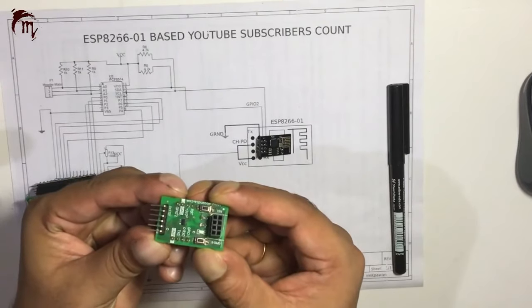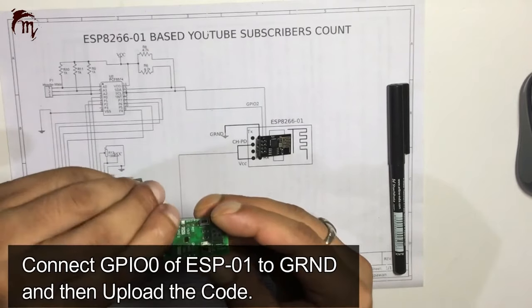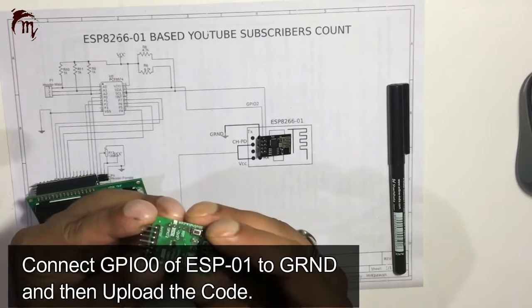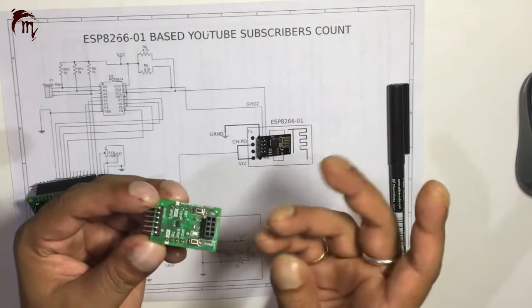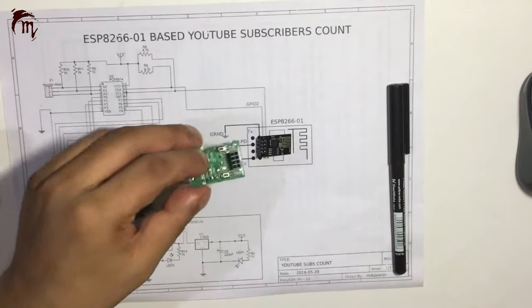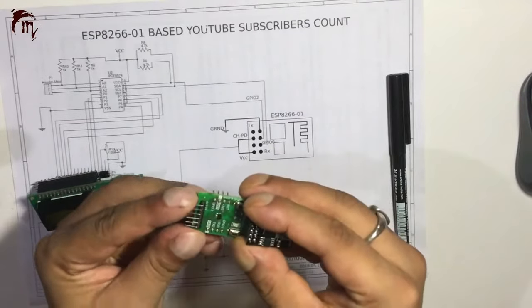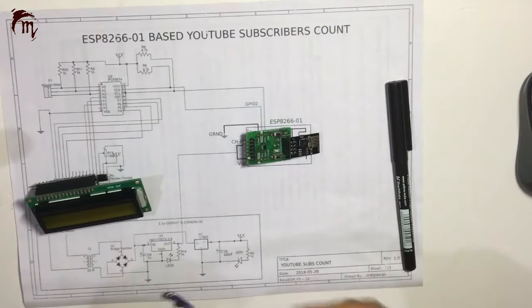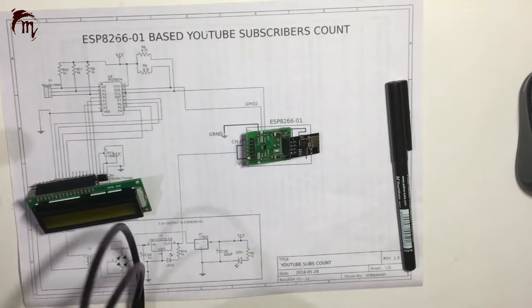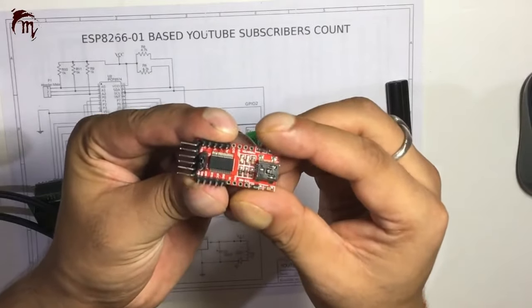this programming module. If you don't have this one, you can do it manually by putting your GPIO 0 to ground first and programming it, and then after you can disconnect it from the ground. So to program this or to connect this one with your computer, I am using a USB to TTL converter which has 5 volt and 3 volt conversion.